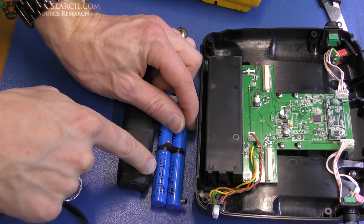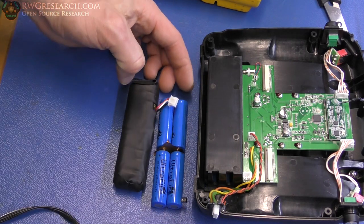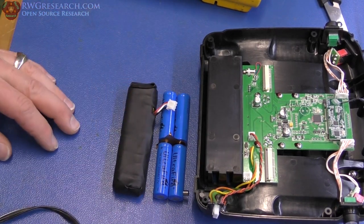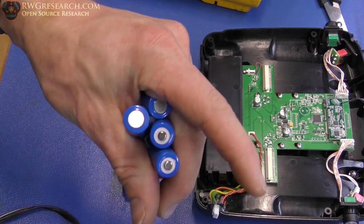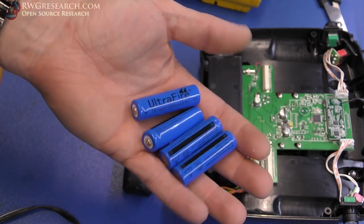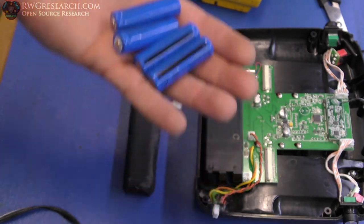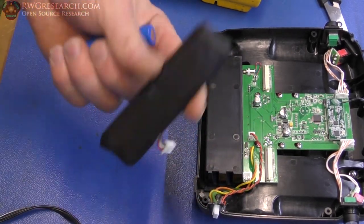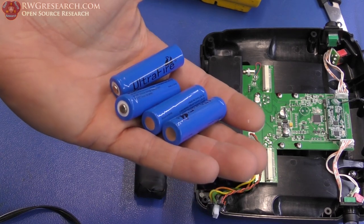It's 1,200 milliamp hour times 2, so that would be a 2,400 milliamp hour pack at 8.3 volts fully charged lithium ion. You might ask why use magnets — why not just solder these? To be quite frank, I actually don't want to solder to these batteries. I don't want to spot weld to them. I want to be able to take them out and use them just like this if and when I need. By the way, this is the same size as a AA battery. The magnets are holding it together, wires are not soldered to anything, and I can recover these batteries without having all that junk on them or damaging them while trying to solder.